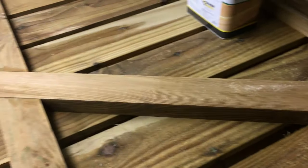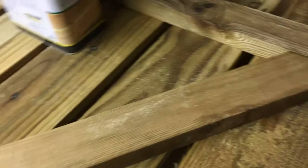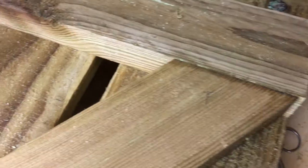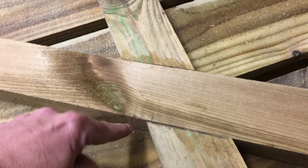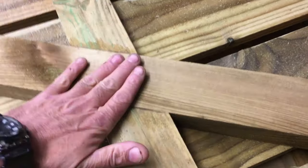So that's the brace in — you can see that down there. This is not really a how-to video, it's just about the bracing. An important thing here is you want your brace to be really tight against the ledge. As tight as you can get it with rough sawn timber — it's not cabinet making by any means. These two joints are quite tight. I just lay the brace on, trace it out, run through the track saw, and then fit the brace in.